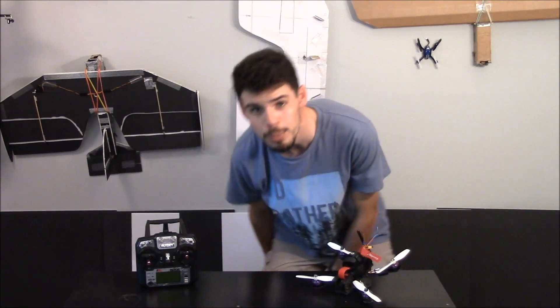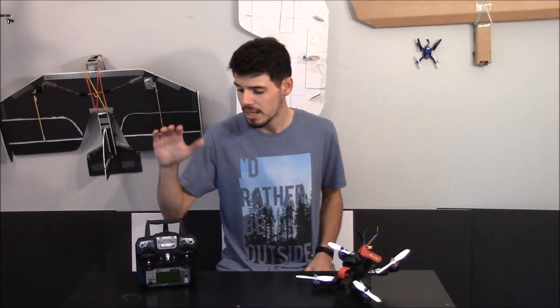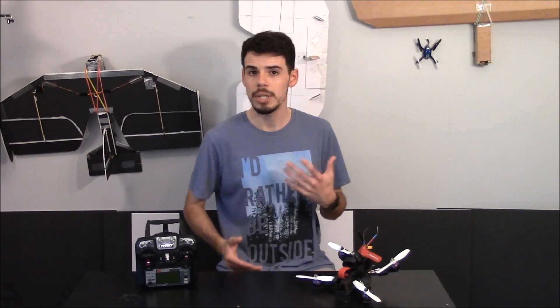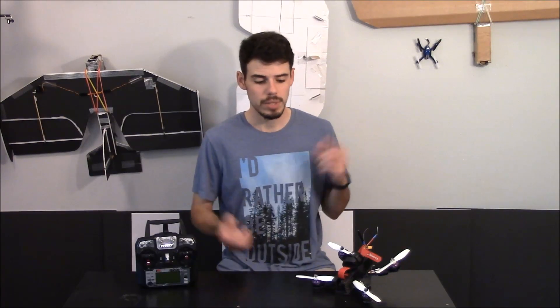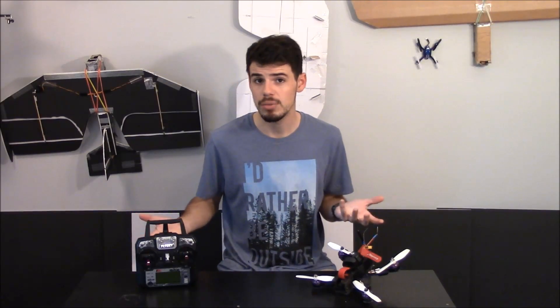In basic terms, it's really pretty simple. It's just the language or protocol that your flight controller uses to speak with your receiver and vice versa. Again, that's different from your transmitter talking to your receiver. The easiest way to make sure everything talks to each other is to stick with the same brand. I got a FlySky radio with a FlySky receiver, and I know from reading the manual on the SP Racing F3 flight controller that it's compatible. I'm using iBus right now.